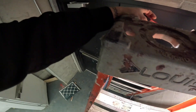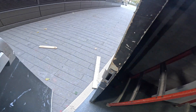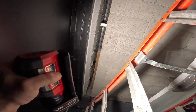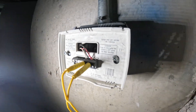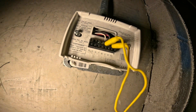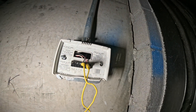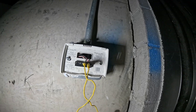I just need a thermostat on this thing and they're going to be all right — a new thermostat and a new filter. Clean up that whole area. They leave this door open at times; the guy's doing construction. These poor birds come in here and start nesting. We jumped R and W, so we sent 24 volts to W and basically energized the heating circuit — telling the system we want heat. We did what the thermostat would do.